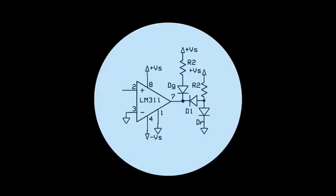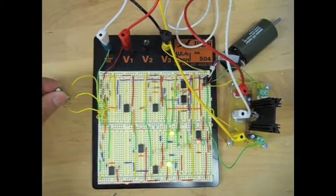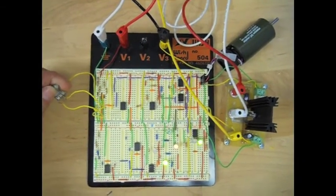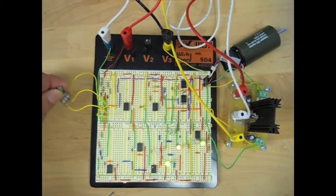For the next part of this circuit, we take the velocity out from the tachometer and we put it through a comparator, which we compare to ground. And based on this, we connect the comparator output to a series of diodes with a diode gate to control whether a green light goes on if it is positive and a red light goes on if it's negative.